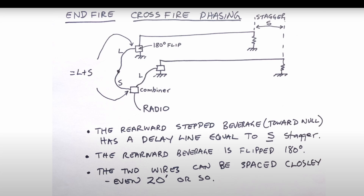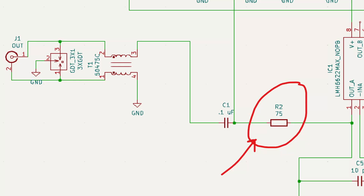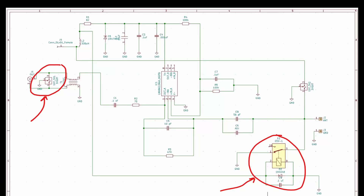In any phased array using coax as delay lines, it is crucial that the feed lines have a low SWR. If the feed point is mismatched to the coax line, then the phase delays can be way off. The output of these amps at the coax connector will always be exactly 75 ohms no matter what's happening on the wire. The trade-off using these amps is the vulnerability that all active electronics suffer outside, especially from lightning. My design uses gas discharge tubes and a disable relay shorting the input when not in use, but they are not indestructible.